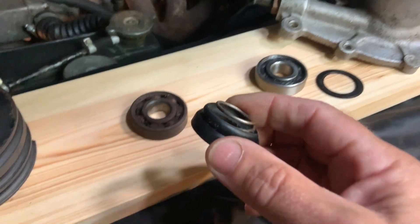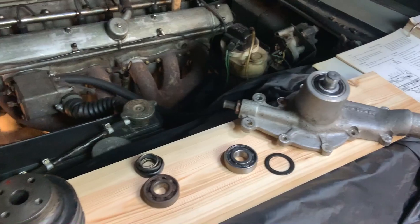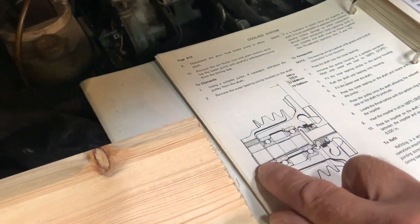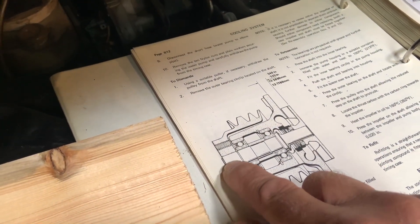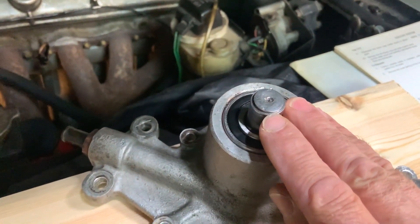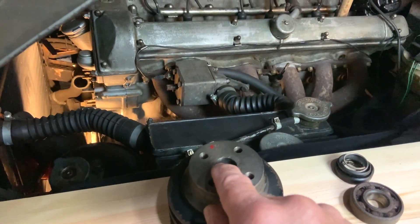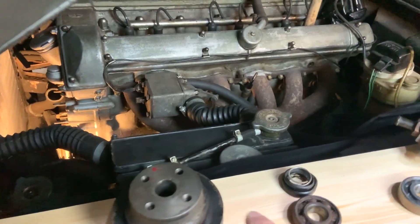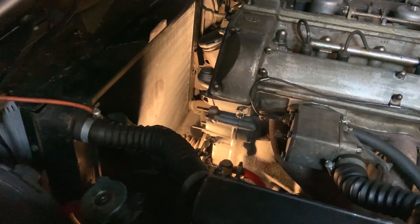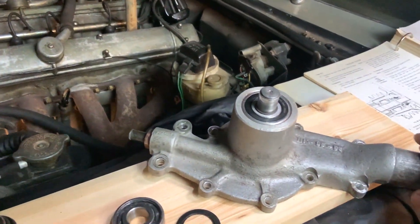The seal and impeller are something I'm going to show you in the next video. But today I'm going over to the hydraulic press in a minute to put the pulley on. I've been looking at the service manual and the pulley has to go on exactly level with this shoulder that my fingernail's resting on. When I took it apart the pulley was over three to four millimetres further forward, hence the slight brushing of the hose coupling on the radiator. It's going to be a bit better when this pump has been rebuilt properly.